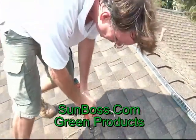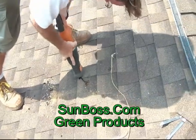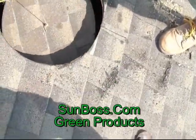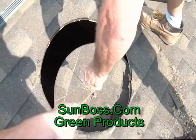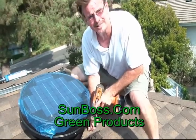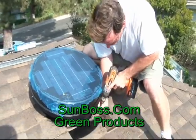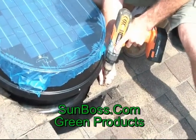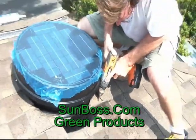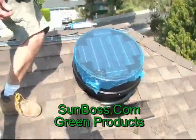I'm just going to give a pilot hole for our blade with the sawzall. The unit is now in place — it's all caulked and sealed underneath, centered in the hole. All we're doing is putting in a final couple of set screws to lock the tile back into place and confirm that the unit is totally set and waterproof.